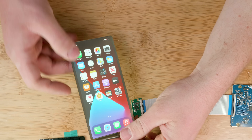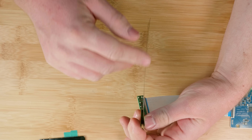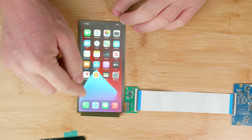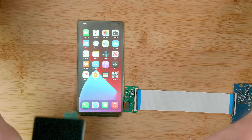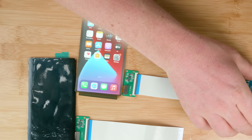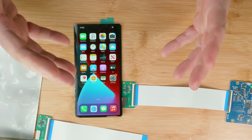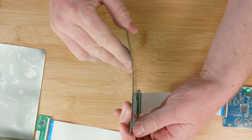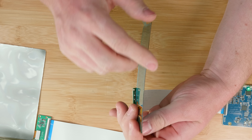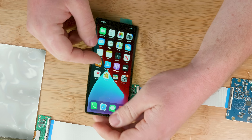This first screen is the one that I showed at the beginning. It's quite flexible and very thin — only about 0.3 millimeters thick, which is roughly three sheets of paper. The resolution is 1080 by 2160, which is pretty good. This is the second screen, and you'll notice right away that the colors are a lot richer and the blacks are blacker. However, this screen is far more rigid, also a lot more thick, and it has kind of some built-in curves which add further rigidity.